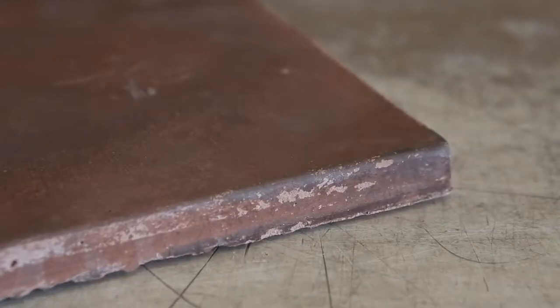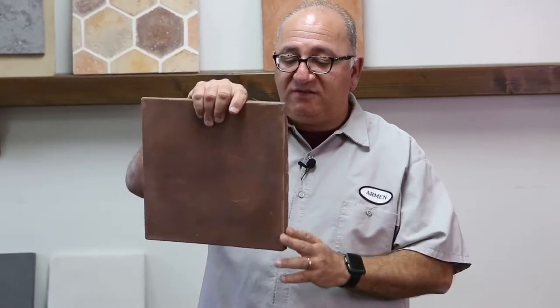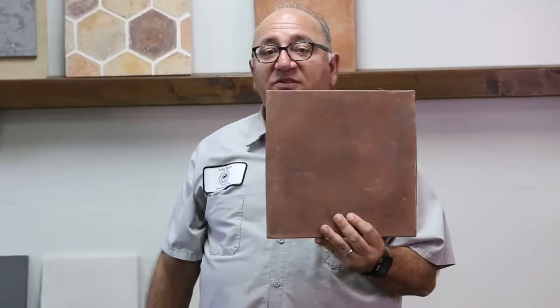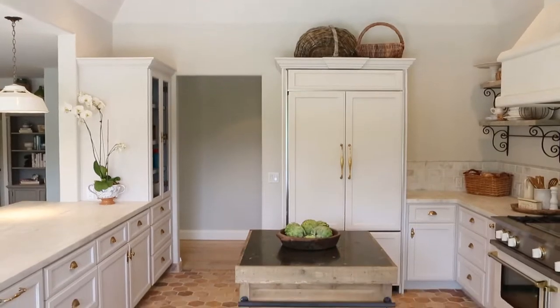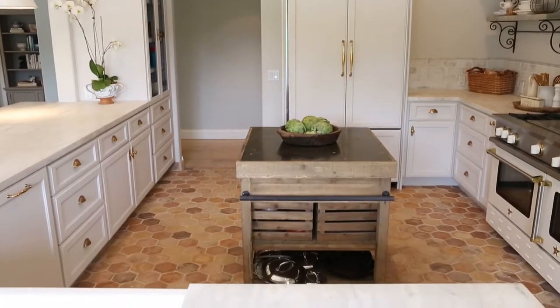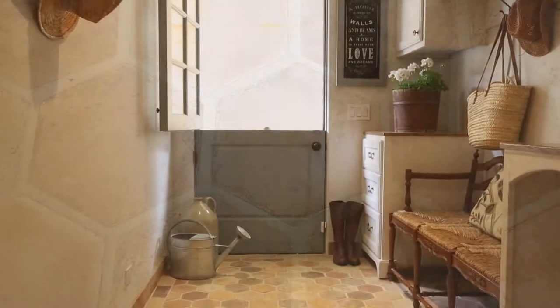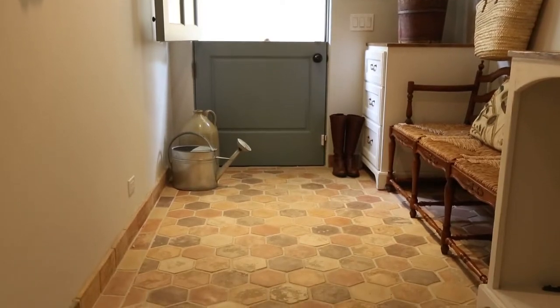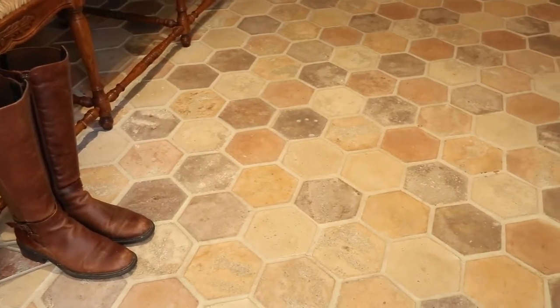The Arteo series is a handmade tile. It's got irregular edges, five-eighths inch thick roughly — basically an old-school paver. Super is a rounded edge tile with the same characteristics, five-eighths thick roughly. The application of color is the same, how the coloring looks is the same — very handcrafted looking on the floor. It is almost an authentic Saltillo paver, minus the fact there's no kiln firing of the product.